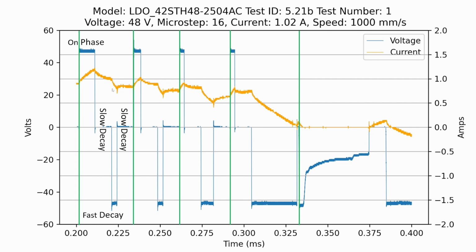And we can see here, back to that same plot again, we have these different sequences here. So on, coasting, brake, coasting, gas pedal, coasting, brake, coasting. And this process repeats over and over again. So this is essentially how we can tune how the driver or how that sine wave behaves. And then during this intermediate phase, I haven't looked into the data sheet for this explanation yet, but again, that's during that transition phase from a positive current to a negative current.